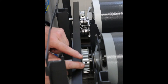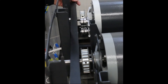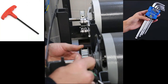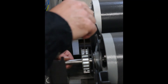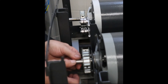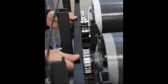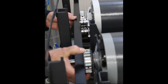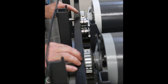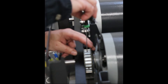The remedy: we'll grab an allen key and loosen off the set screws — the grub screws — at both locations here on the shaft, push this pulley back, and get them properly aligned. Now we're just going to gauge how much the pulleys need to be moved. If both sides of this pulley are in contact with the bar, and both sides are in contact with the bar at the other end, these pulleys are now considered to be aligned, and I would simply tighten up the allen key.